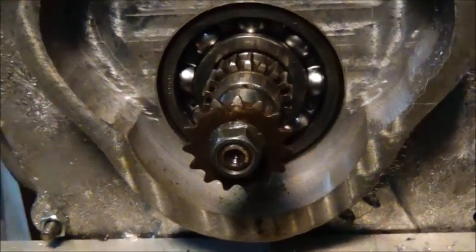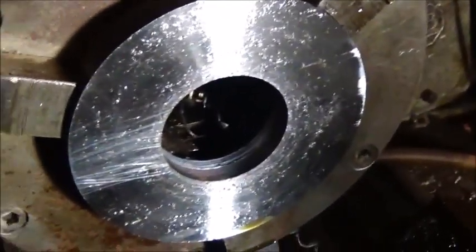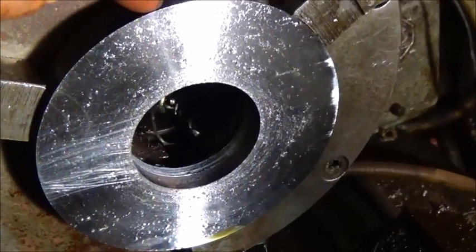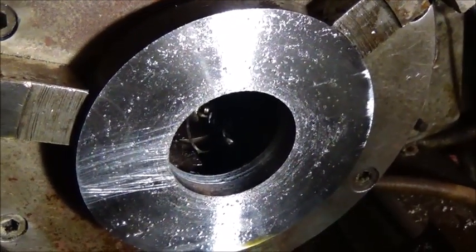Let's see if we can find something to make this flange to hold this thing in. All I could find is this - it's bigger than I need but I'll turn it down. This is a brake puck and it's got brake lining material bonded to it, so we're going to put it in the lathe and see how well that stuff comes off. A friend of mine gave me a bunch of these - looks like it might be about five-eighths thick. I took that brake surface off, took every precaution just in case it was asbestos - wore a mask, came off no problem. Got a two-inch hole in it and I'll get back to work on it. Appreciate everybody watching - till next time!